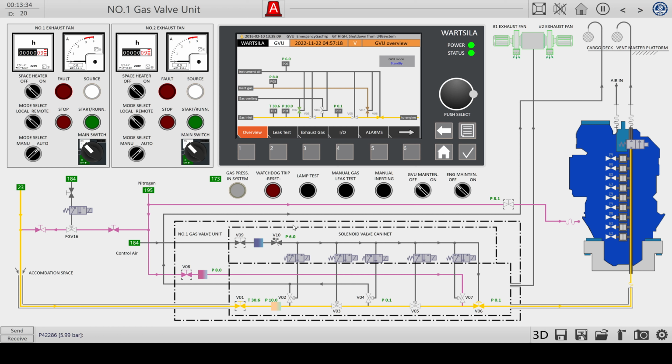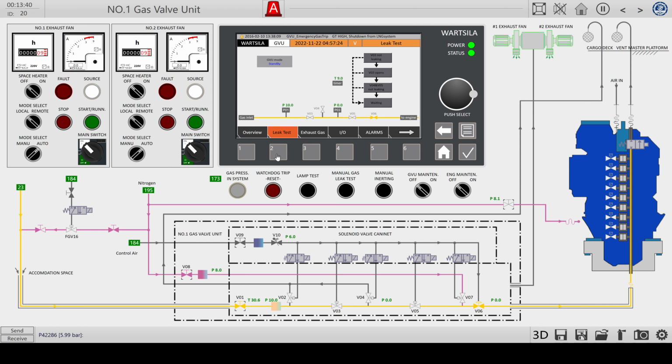Second phase that the engine is doing is a test that we can also do manually. There's a leakage test. You can follow that with this page. First, it's going to check all these main valves if they are working correctly. I guess they're putting pressure on the left or right side and measuring if there is any feed through. So it already decided valve 3 is okay now. So now we're going to check valve 4 and 5.